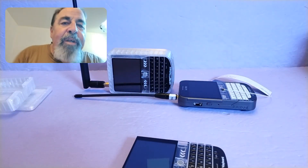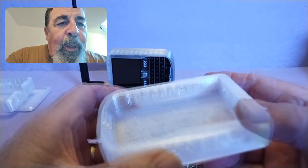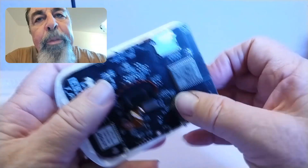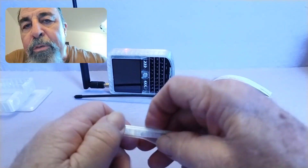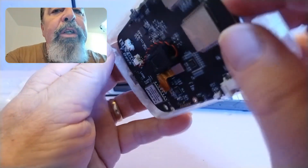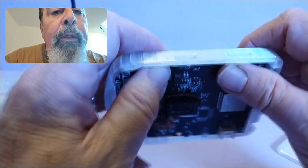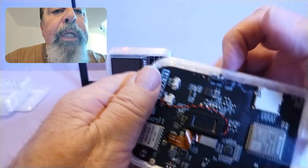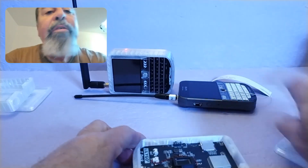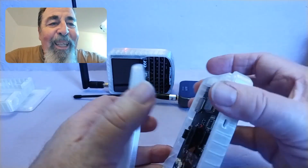When we talk about AlleyCat, this is the S front and S back — the most compact case that AlleyCat delivers. You have to be careful to make sure the switch is in the same position, because this switch just pops in and out of that slot. You've got to carefully guide the switch in, otherwise you're going to bust off your switch getting your USB port lined up. Then you just start working it in — and we're in. Check the switch — switch works. Here's the problem: the speaker is flush with the back, so the depth of the back is all the room you'll have for a battery.